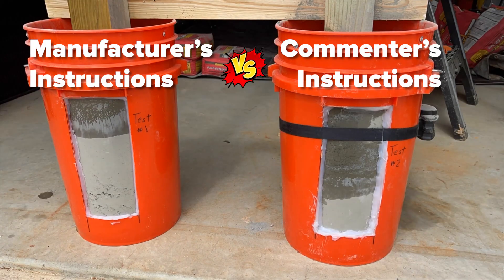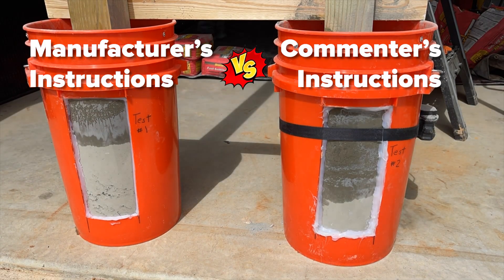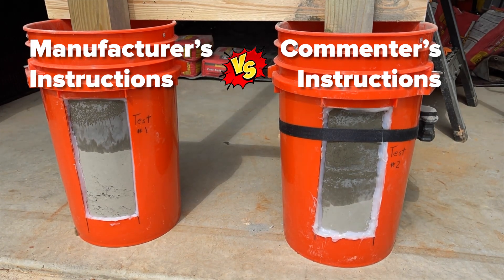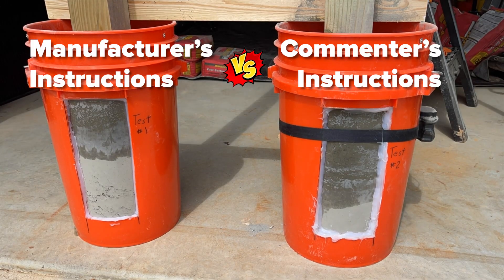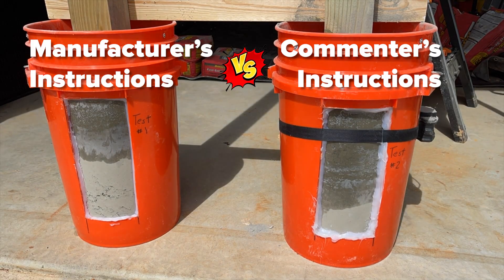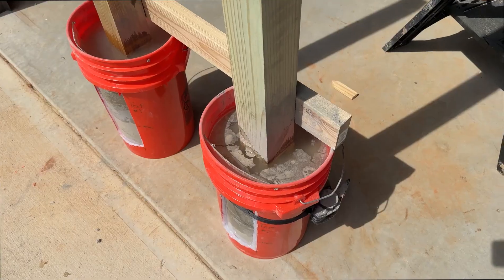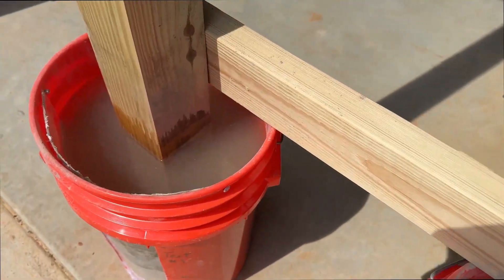This is a 30-minute time lapse. In the first 30 minutes I was able to add a complete gallon and a half to both sides and then just let that water pull down through. On the left hand side, all dry mix with water on top, it continues to pull lower and lower, while the right hand side started much lower but seems to be progressing a little bit slower. At the end of the 30 minutes we still have plenty of standing water on both test one and test two.